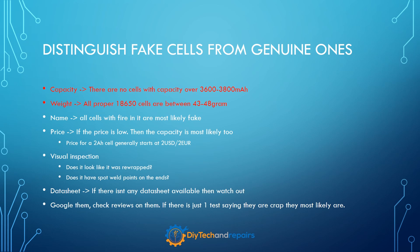Visual inspection as we looked at — does it look like a re-wrapped cell, or does it have spot welds on it but still claim to be new? Check once more. Data sheets are also a common indicator — if they have data sheets on the page then it is most likely a proper cell, but most fake cells do not have any data sheets and you cannot find them later. And of course always google the cells and check the reviews of the sellers. If there is even just one review stating the cell is bad, I would consider that one more trustworthy than all the positive ones.